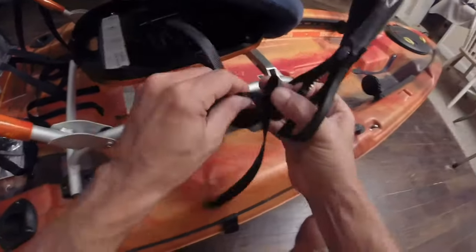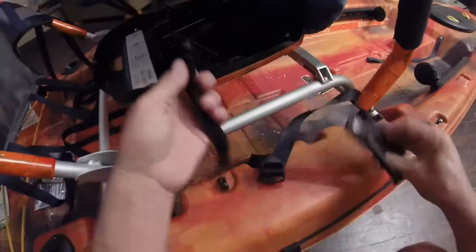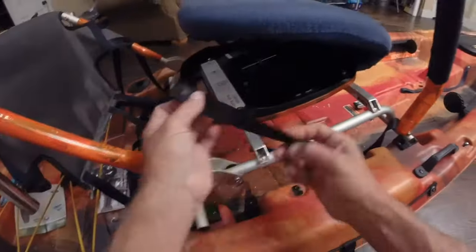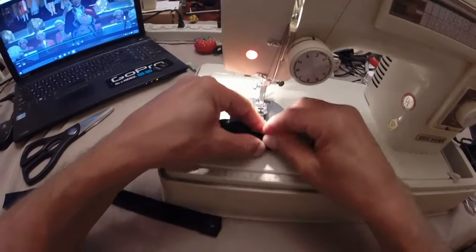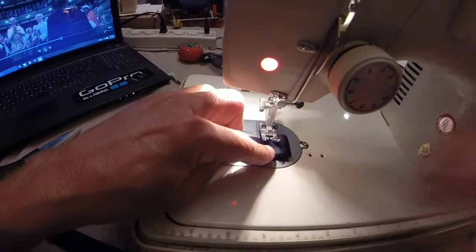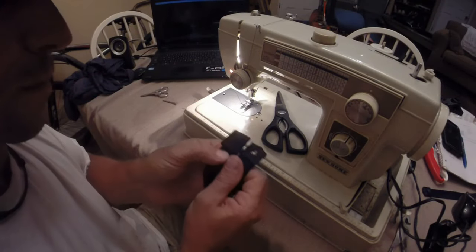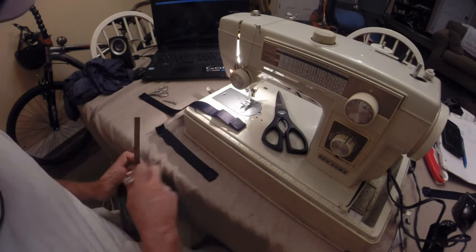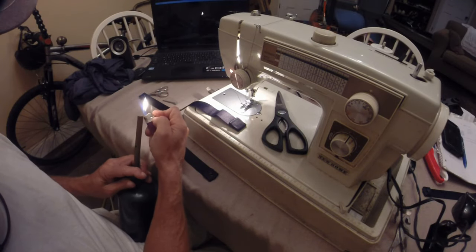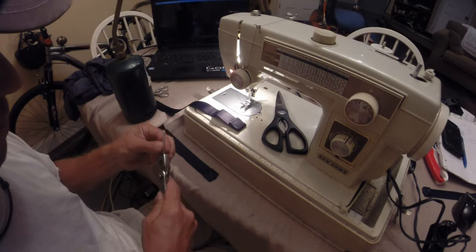While I still had the sewing machine out, I figured I'd extend these straps. The old ones just had an end folded about four times and sewed together, and through those four layers a hole was burnt. It looks like they used a hot punch or something. So I'm just going to use a propane torch and a roofing nail that I'm holding with a pair of pliers — it should work real fine.